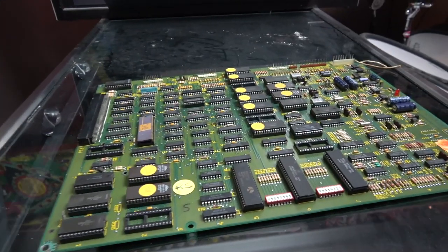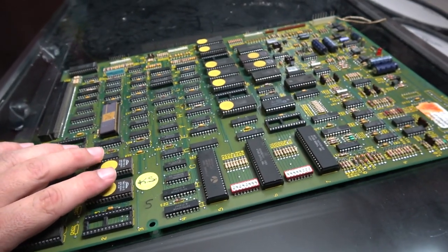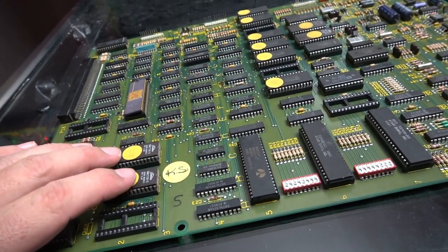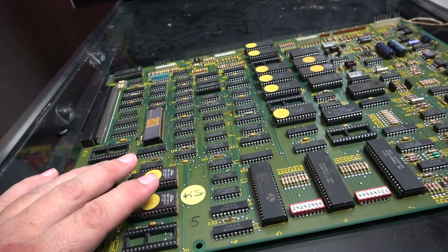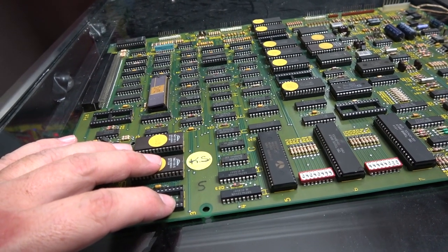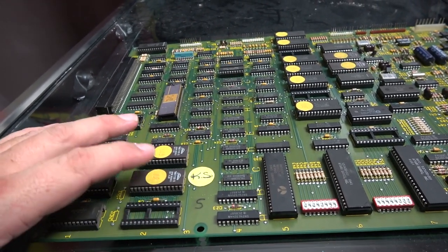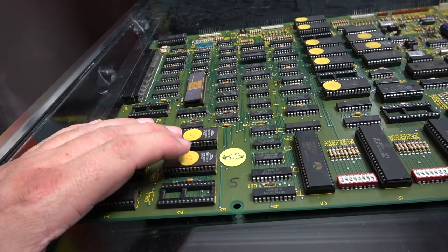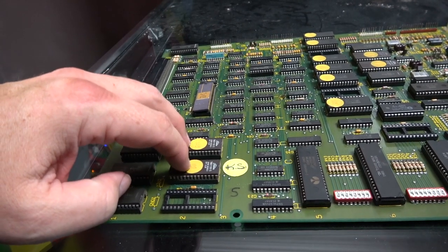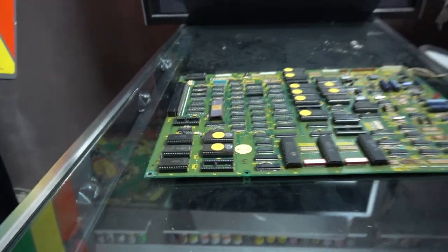After having a think, I realized that on the original Super Sprint board when I first took it out, those two chips were in the wrong place. Based on internet pictures I moved them to what I thought was the right place, and that caused the problems we just had. Then I realized I might have them the wrong way around, so I swapped them — flipping them around in the correct spot. As soon as I did that, I got a bit more success.